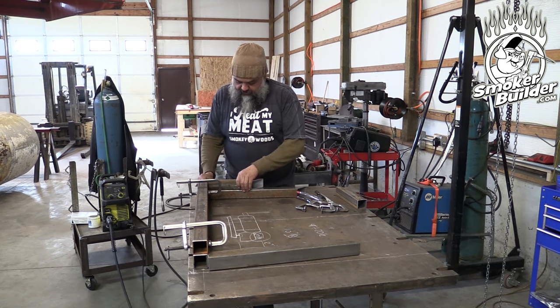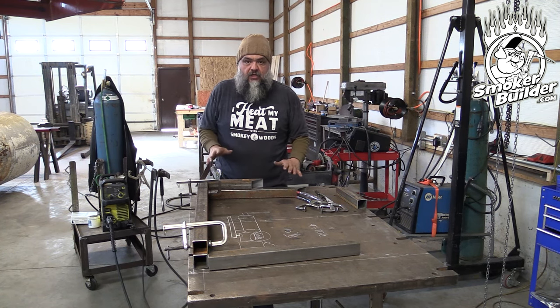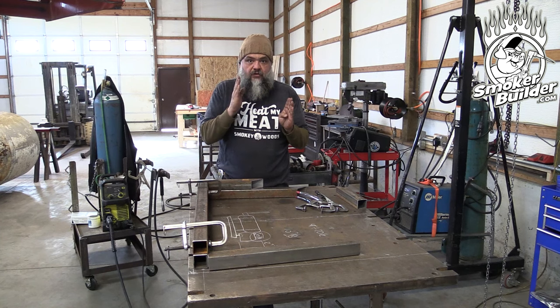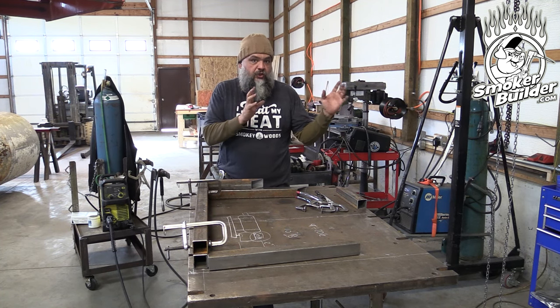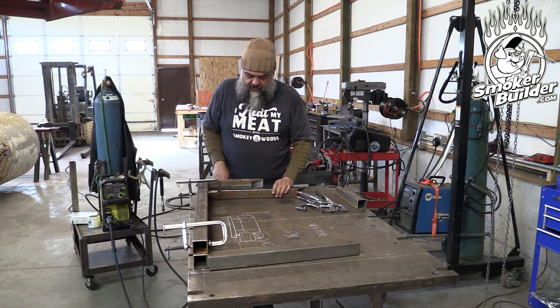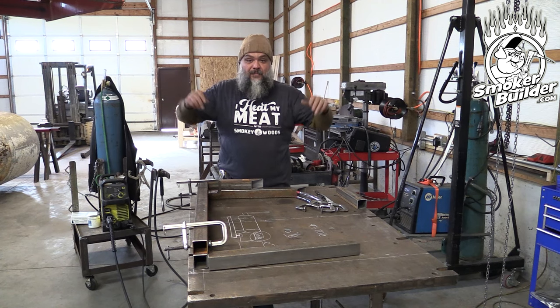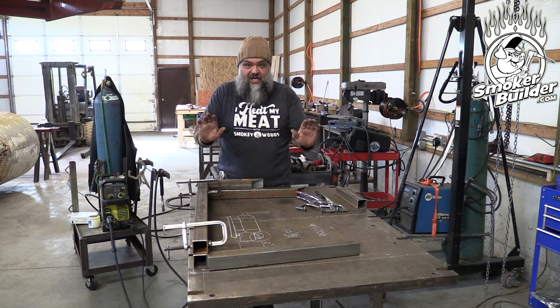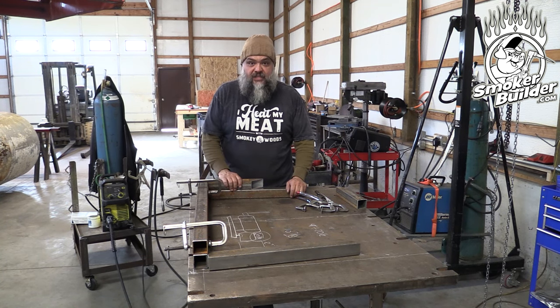Here's our leg, we're going to tack this on and tack the other side. Once this final third assembly is done, we're going to take all three and lay them out on the rail according to where we think they're going to look good on the cooker — two on the cook chamber and a little guy on the firebox. We'll get all that tacked up, then lift the whole cooker and slide this underneath and slowly bring it down to see how all of our homework planned out. Let's get this tacked up.